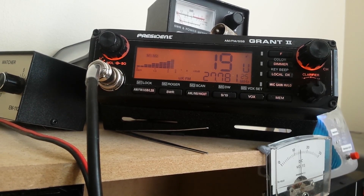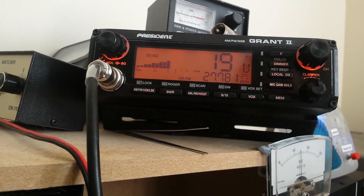The antenna's receiving, although I'm getting about S3 of noise, which is a little bit annoying, but there's nothing I can really do about that right now. So I'm all set to go on the air. What I'm going to do is swap the coax over to the other radio and try to set up the Zello gateway — that's another video.